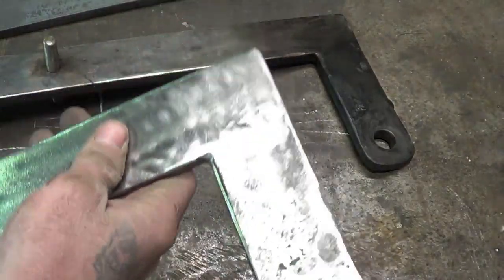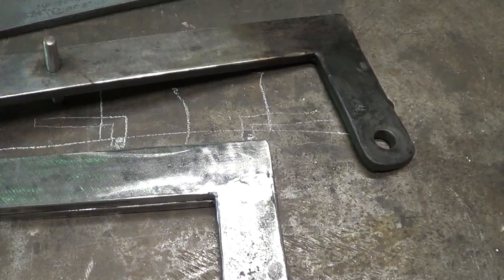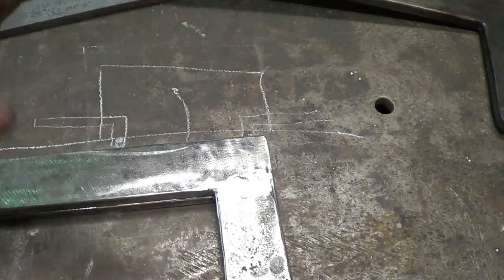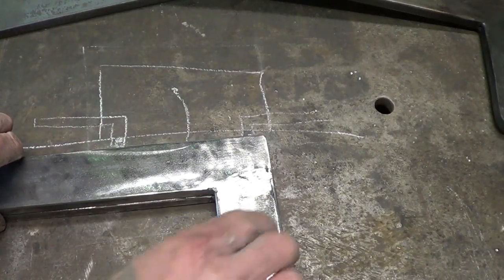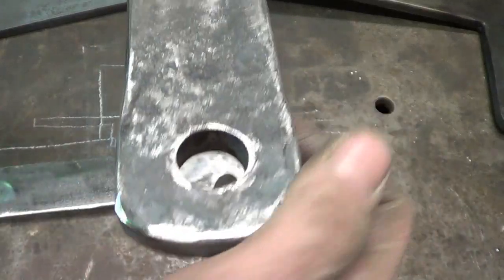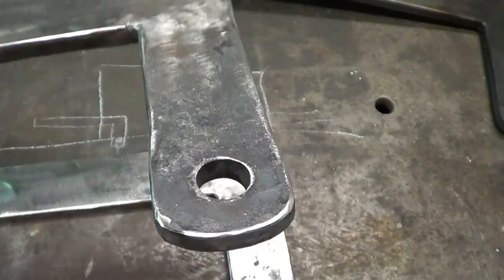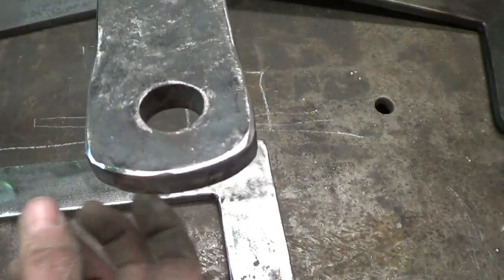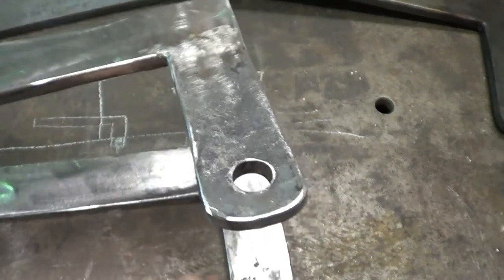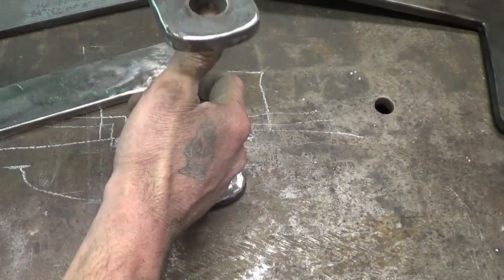So you kind of missed the forging part, but here's the scoop. He's going to take these brackets and install them. And I need to continue on with the design of the swing arm or the crane part, and I'm not exactly sure how I'm going to do that. I'm not sure if I'm going to put the arms in and drop a pin between the two of them, which would be the easiest thing to do, but I don't know how much overhead space I have, or if I'm going to have the arm come in at an angle and then set in both holes.